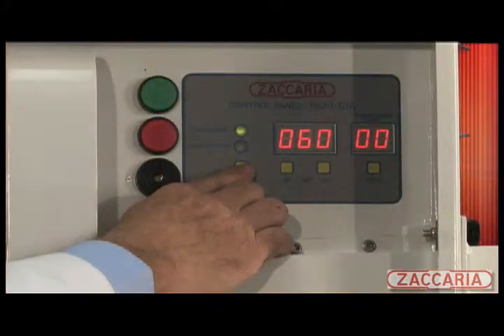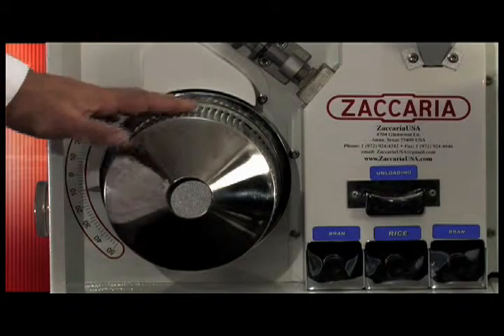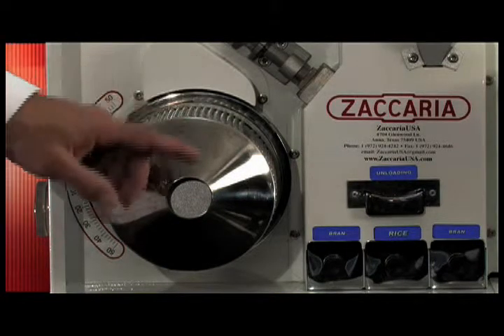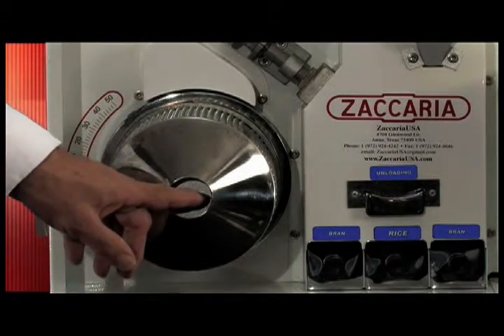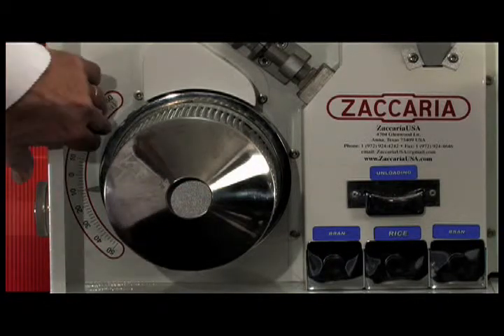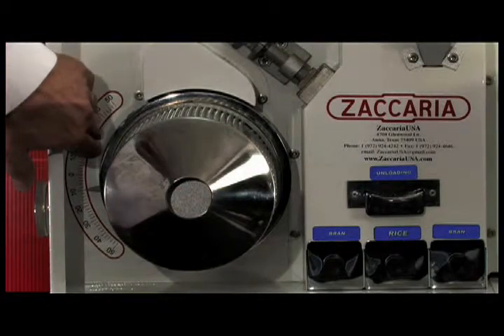In the second operation, we switch to the calibration sequence and use the indented cylinder separator to separate whole kernels from brokens, or various fractions based on the selection of the range of cylinder pocket sizes. Also available as an option are perforated and slotted cylinders for removal of red rice, immature and chalky rice.